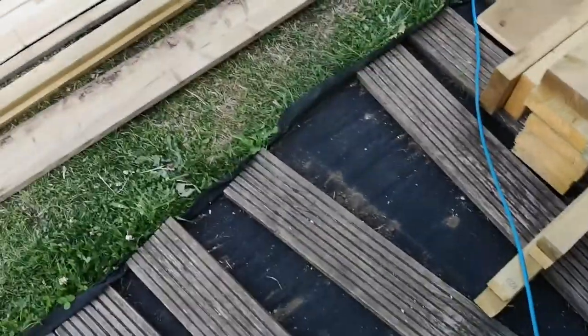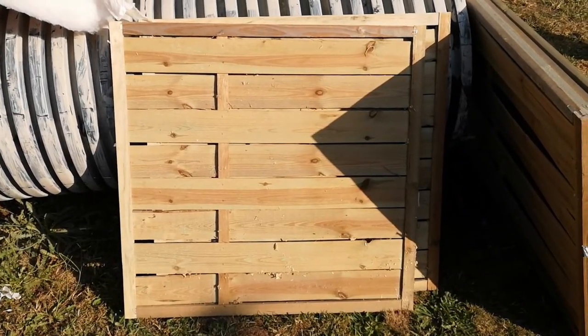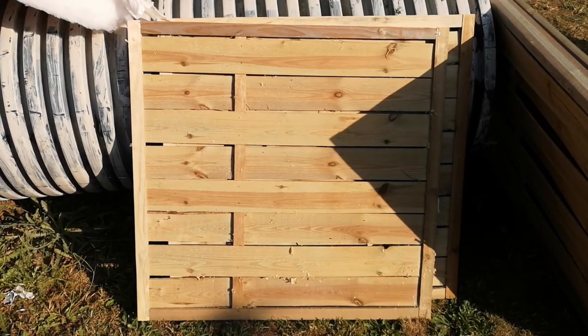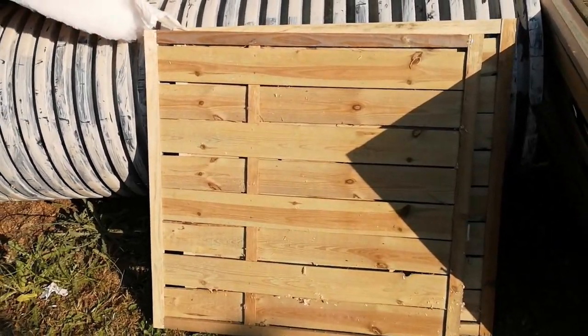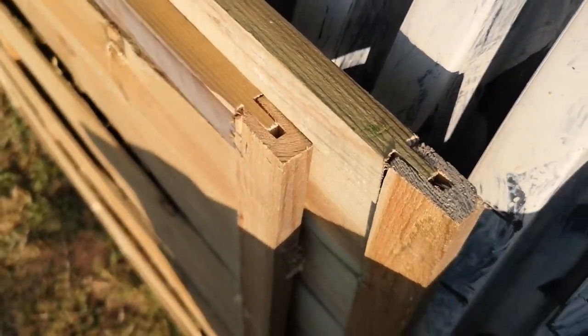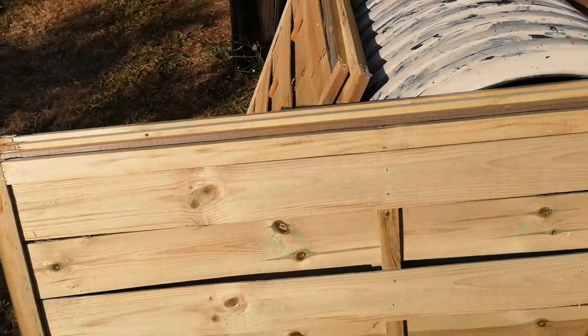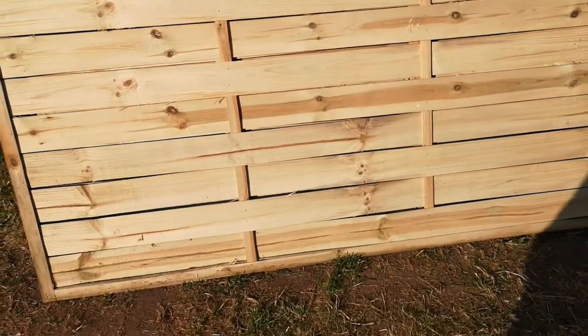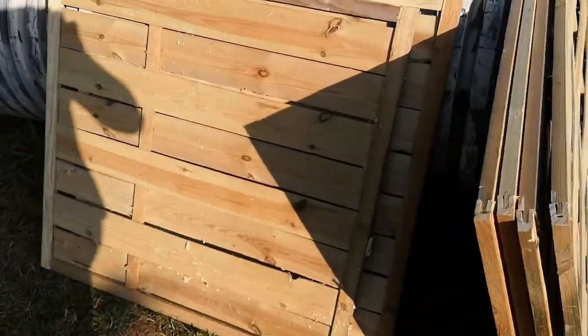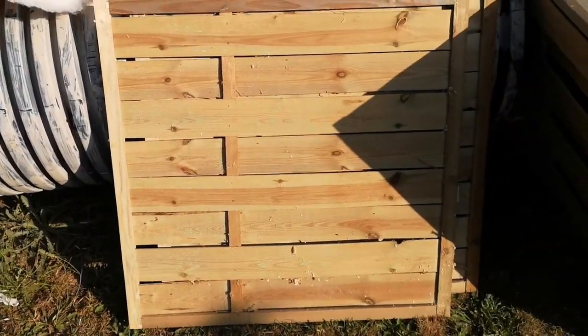And there's our 2 half panels. An inch over half in total, so half inch each, because of the overlap. So we go half height, obviously with a gravel board as well, they'll be 3 foot 6 inches roughly.